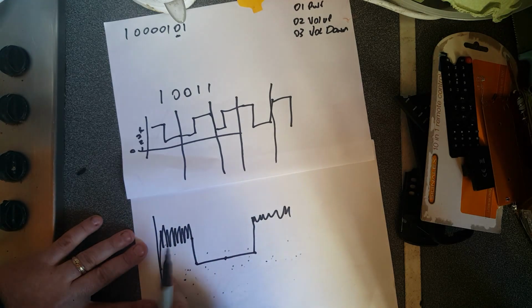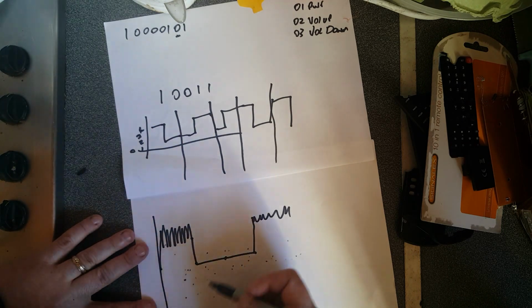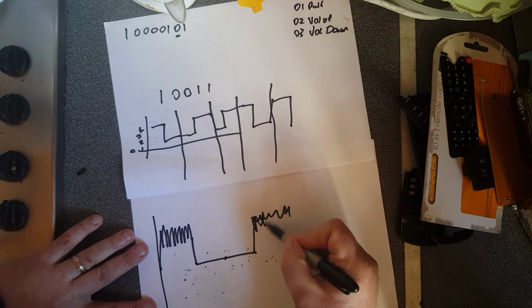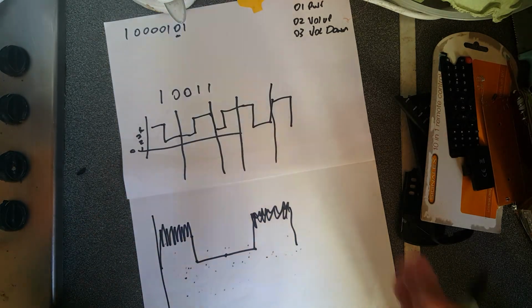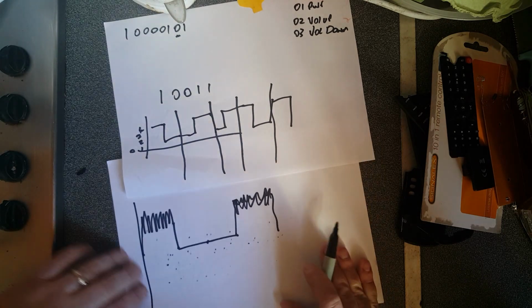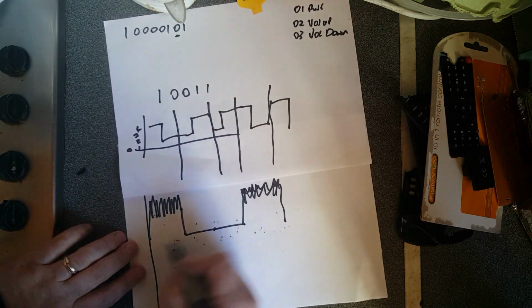That kicks the process off, so the receiver in the television is expecting to see a burst of 38 pulses. And then it would wait to see what comes next. It would expect to receive one of two things next, and then it starts buffering what's coming in, passing it to the IC circuit, which would then try and decode it.